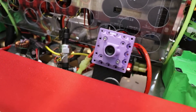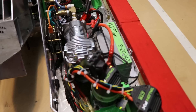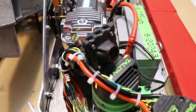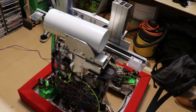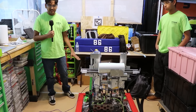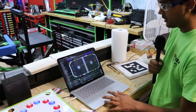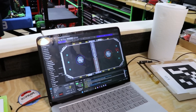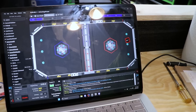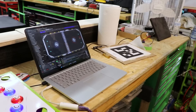These cameras were modeled in CAD and we found the exact angles and degrees necessary to get as much AprilTag coverage as possible, giving us full field localization using PhotonVision. With each of these cameras running at 30 fps, you can see on Advantage Kit that — right now we moved the reef all the way outside — but you can see a live update of our robot according to just a single AprilTag. With 22 AprilTags around the entire field and a 360-degree field of view, full field localization is possible.